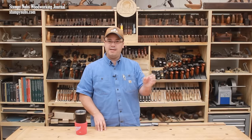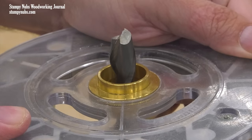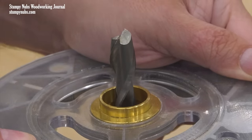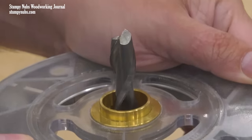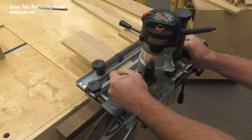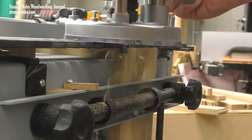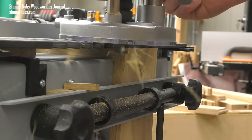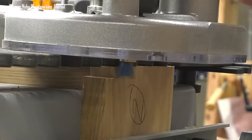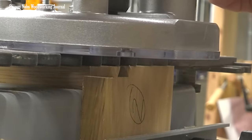With a bushing that remains stationary, you may extend the router bit in stages, cutting the full depth of the mortise a little bit at a time and stopping at whatever depth you like, regardless of the bit's overall length. A dovetail jig presents a similar situation. The length of the joint's pins must be equal to the thickness of the mating board. You must be able to adjust the cutting depth of the router bit accordingly while still keeping the bushing against the jig's guides — this would be very difficult, if not impossible, with a bearing guided bit.